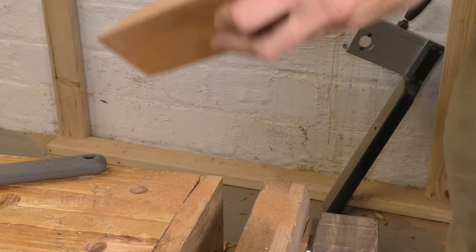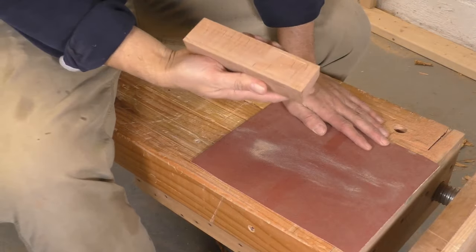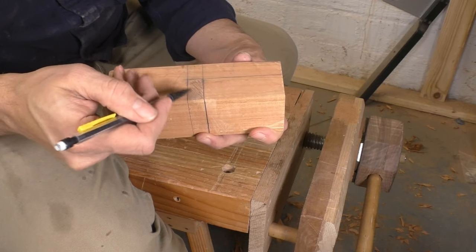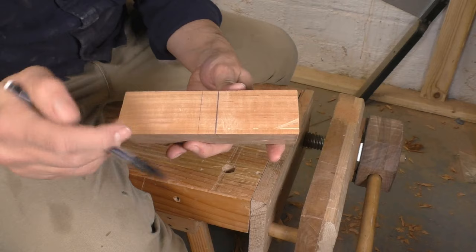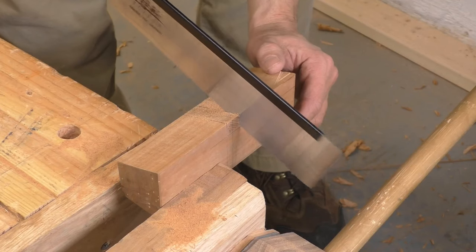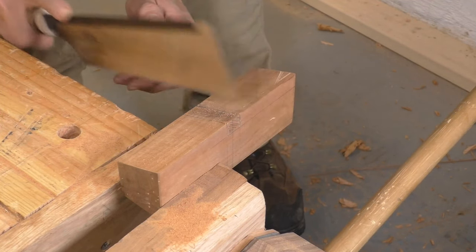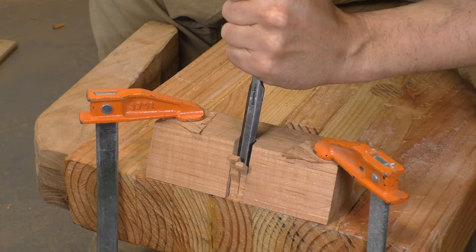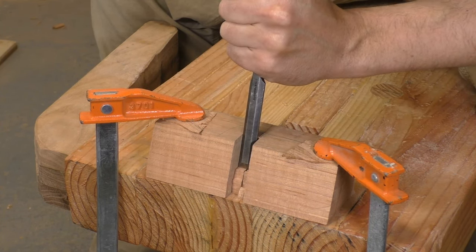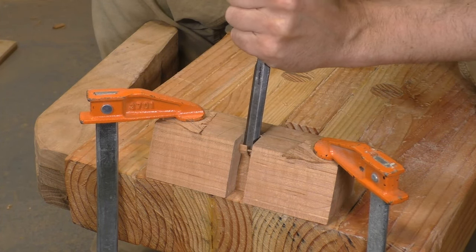The faces of my cut need a little cleanup — you can plane those, or just put a piece of sandpaper on your bench and sand them flat; both approaches work fine. Now I have full access to the inside of my plane, and it's easy to mark out the exact location of my mortise. Instead of chiseling the whole thing out slowly, I can quickly cut accurate sides with my dozuki saw and then chisel out the waste. I also sawed another kerf right down the middle of the waste, and that's making it extra easy to clean out the bulk of the material.